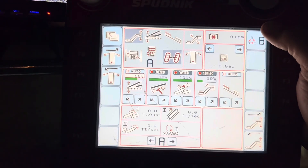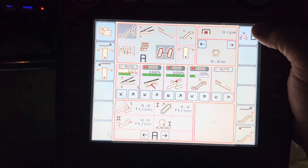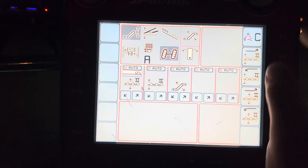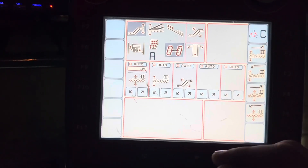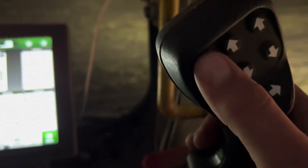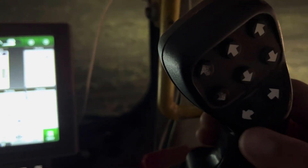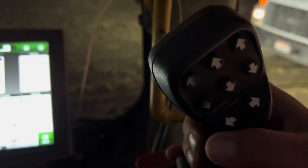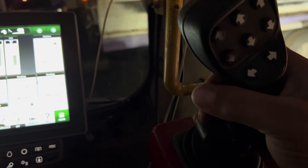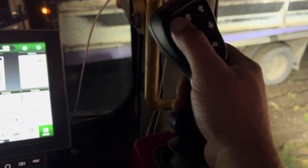Let's go to the next page — I don't really use much of that. That is my multi-step table; I have those both all the way down and out. The buttons on here: this is the boom tip up and down, the digger points up and down — I don't use that one. This is my steering left and right. The auto boom up and down is on the back, and then the pinky is the auto return to center on the steering.